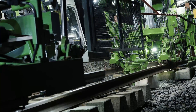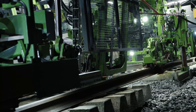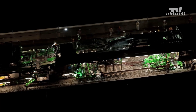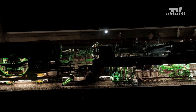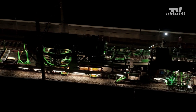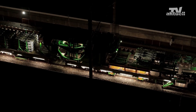The manipulator rotates the sleepers by 90 degrees, then lifts and transports them to the sleeper lift, which takes them to the first level of the machine. The removed sleepers are then transported to a sleeper conveying system and deposited in groups of five. The machine's gantry unit can transport up to five sleepers at once, taking them from the sleeper conveying system to the transport wagon.